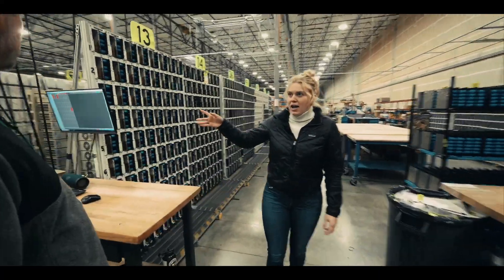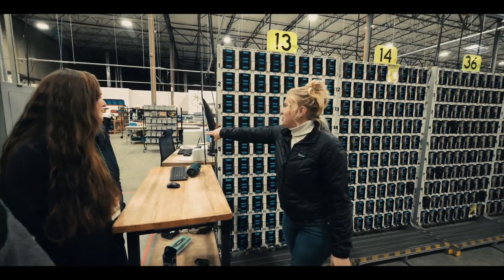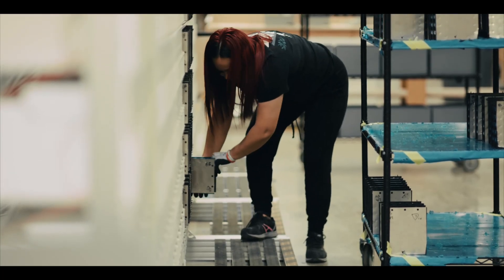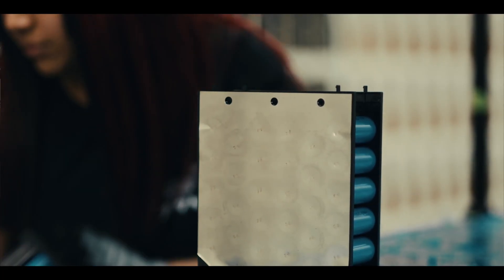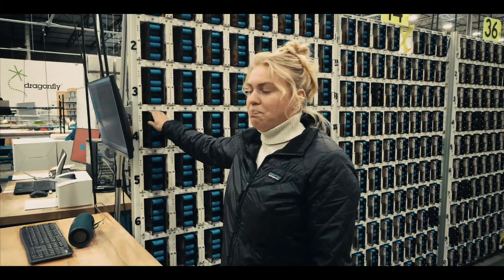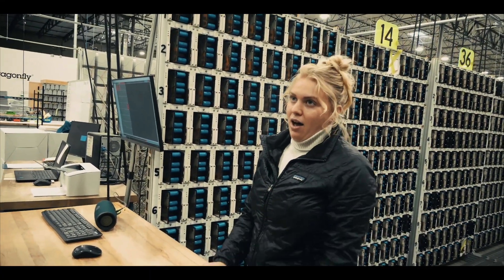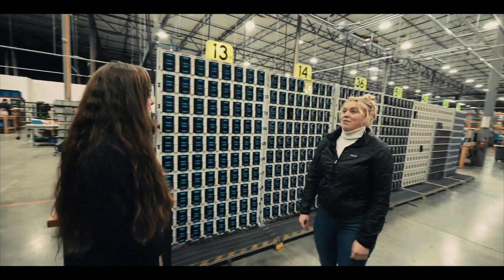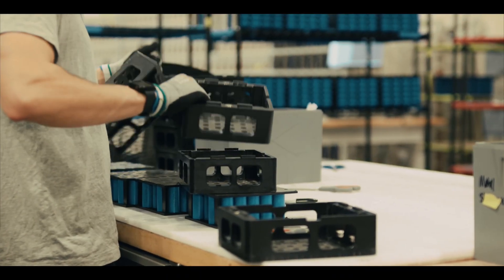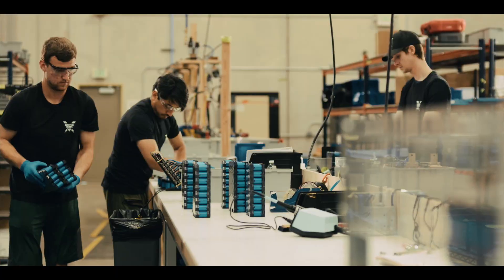Within the cycler station, it's monitored by a computer program called Captain Crunch — the engineers named it that. It's monitoring each one of the slots that we've put a mod pack in. Every mod pack has to go in a slot, whether it's our big batteries or our small batteries. We're going to discharge these all the way down and then charge them back up, and we're actually using the energy you took out of it to recharge. That way we can see the capacity of each one. They have to be matched to a tenth of a volt. A lot goes into making just one battery. You have a whole team here matching each mod pack and they're going to start putting them into the bins that battery is going to be built into. Then we actually serialize it — this is when your battery actually becomes a battery.